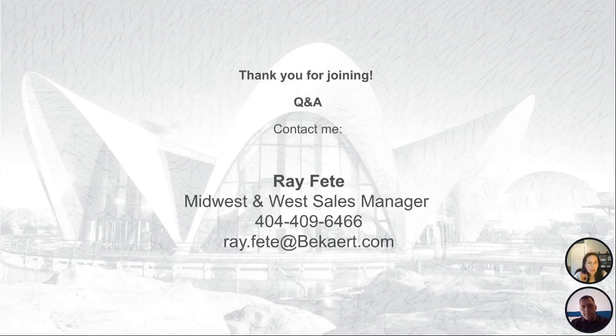And I'll also just add, tacking on to this, Laura, it's kind of unusual to see a 5D fiber in a typical flooring application. We do tend to see the 5D fibers get used in more of the structural projects or a floor on piles. A structural mat foundation might be where a 5D fiber is used. But when it comes to galvanized fibers, that's usually in cases where it's really aesthetically sensitive.